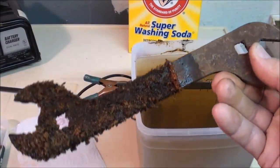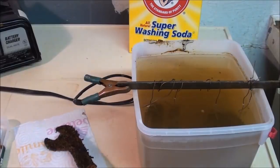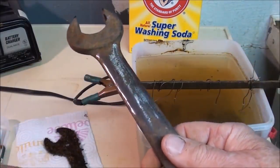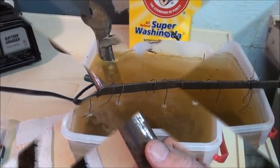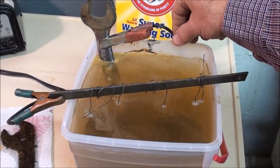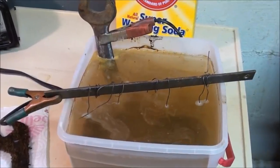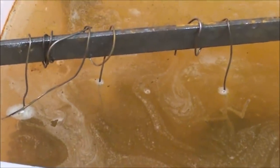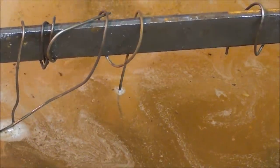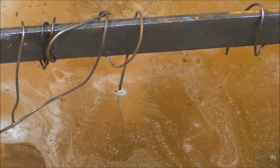This is the stamped wrench that was in there, and that's how much niter has become encrusted on it from doing just one gear. Just so you can see what happens here, I'm going to use another brand new 70-year-old wrench, and I brightened this up a little bit here so I would have a good electrical connection where I put the clamp. There's the anode — the positive. And the battery charger was just plugged in 30 seconds ago — look at the action already. There seems to be more action on the gear closest to the anode. The solution — I think we'd call that an electrolyte.